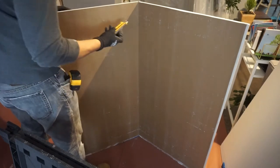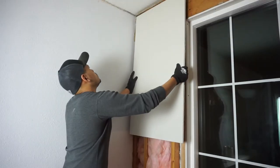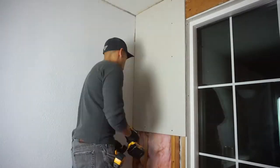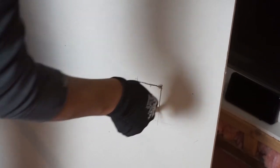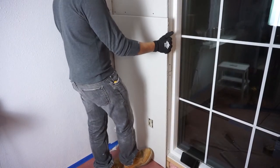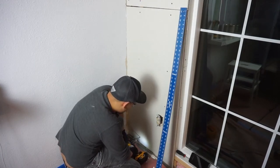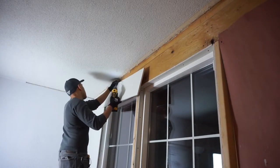That's one window down. Now I have some extra drywall here — again, I don't want to waste material, so I'm cutting everything in half. I'm starting with the top portion and just placing it right against the wall, making sure it's nice and even. Using the drywall saw, I'm cutting around where the electrical socket is going to come out, then placing the piece right there at the top. I'm using my T-square to find the studs and then installing the drywall screws. Do the same thing on all your windows if you have more than one, then put everything on the top portion of the beam.